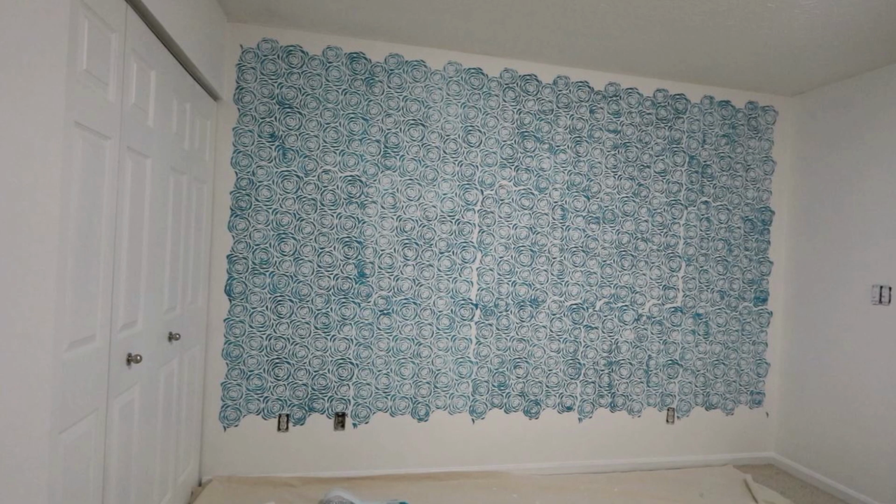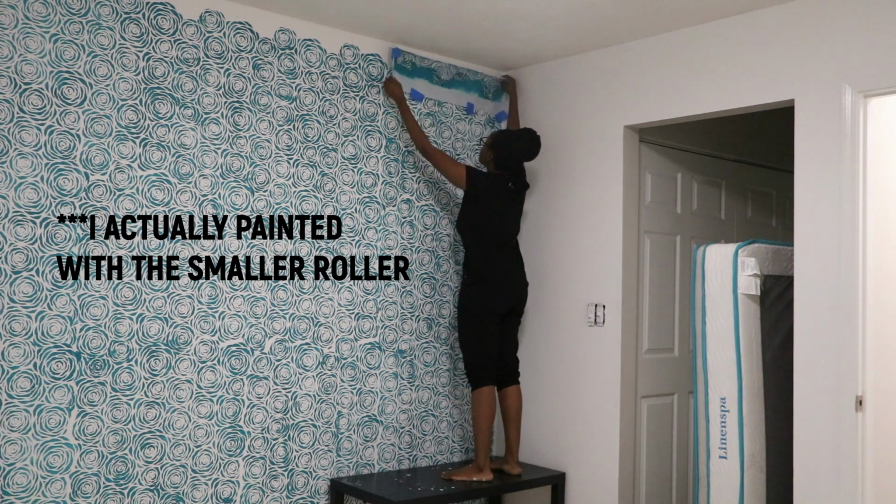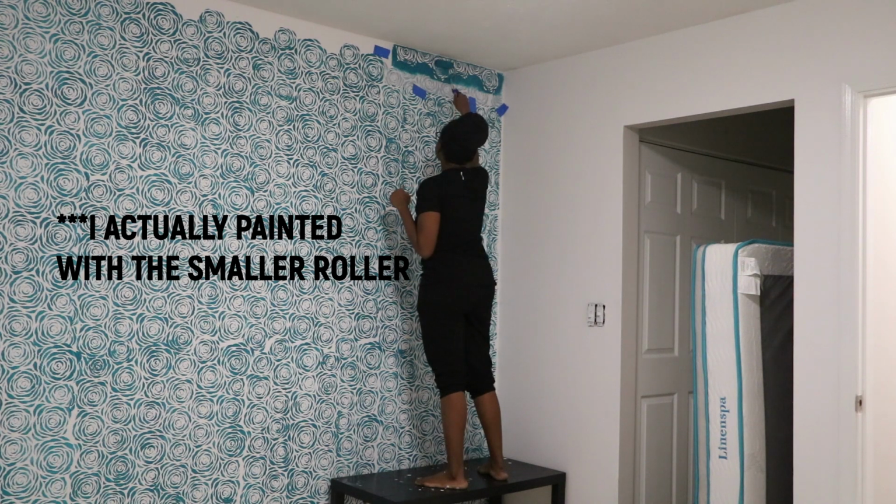So that finishing piece is what you use for the ceilings and the baseboards. When you take the stencil and you fill in the whole wall with the big piece of the stencil, there are going to be spaces in between the ceiling and the baseboards and the corners of the walls, and it looks like the stencil has a white border. You could leave it like that if that's the look that you're going for, but I wasn't. I wanted it to be flush against the ceiling and flush against the baseboards and in the corners. There's a sliver of stencil that they give you in the package that is smaller than the rest of the stencil, and it's easy to push up against the ceiling. With that sliver piece, you go in with the smaller bristle brush when you're up against the baseboards and when you're really, really close to the ceiling. It was really helpful. It did take some time to get that right. Again, that piece is crucial if you want your walls to not have a border around it and to be flush with the ceilings and the baseboards.